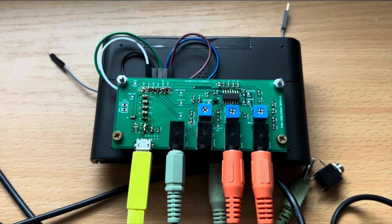Another difference is the gate. Since the only way to normally operate the Monotron is using a touch strip, the gate is not really needed — the signal is physically connected upon touching the strip and disconnected upon releasing it. However, this is not the case with standard pitch control voltages, which remain the same throughout whether you're pressing a key or not.